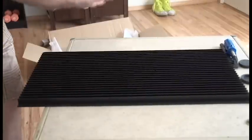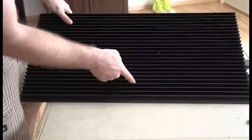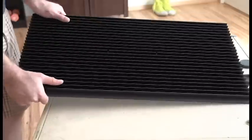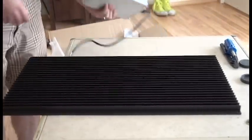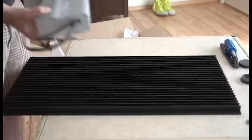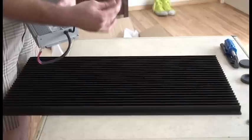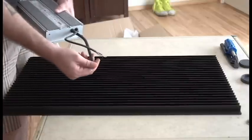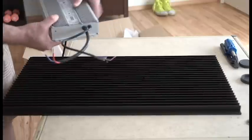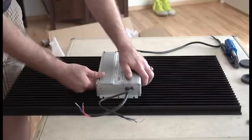So, one thing you will notice on this heat sink here is on one side you got a hole there and you got a hole there. On the other side, however, you've got a hole there, a hole there, a hole there. I'm assuming that that's for us to run our wires through from the boards through here to wire it into that. That's how I did the assembly on the last one. So what does that mean? That means you're going to take your power cord end and you're going to put it on the left-hand side if you're looking at it where the extra hole is on the right. So where there's two holes rather than the one, you're going to want these little skinny ones. This is going to be for our potentiometer wiring in. This red and the blue, okay? This is hot or positive. This is your negative. We're going to use that for wiring our boards in series, okay? But first things first, those wires go on the side where there are two holes.